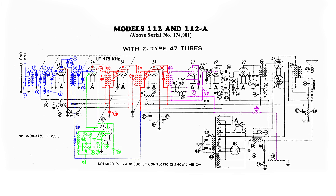The 27 tube amplifies this audio. It goes through capacitor 40, through the volume control, to the grid of the next 27 tube, which amplifies it further, then goes through an audio transformer whose secondary is center-tapped. This gives us a push-pull setup — each end of that secondary is 180 degrees out of phase — which drives the grids of the two 47 output tubes. Now we have enough energy to drive a speaker. That's the signal flow through this radio.